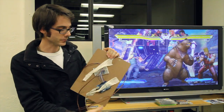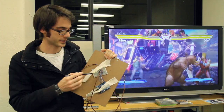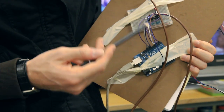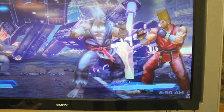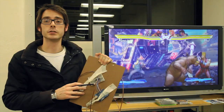As you can see, the Arduino is connected up through wires to the paperclips, and then there's one small resistor for each line that pulls up the signal when we want it to. This way, we can have the inputs come in from the paper, go into the Arduino, and then get sent out as native PlayStation controller signals.